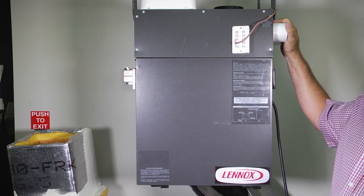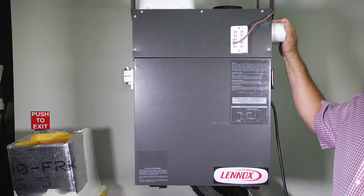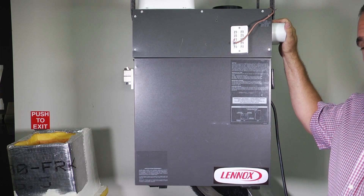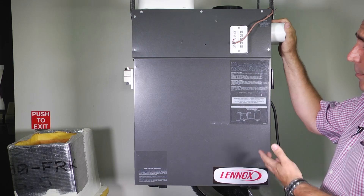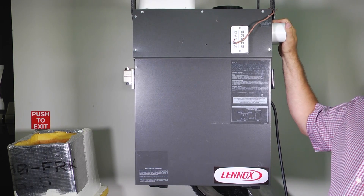What happens in a lot of our northern climates is in the wintertime we want to keep the house warm, so we shut up all our windows and doors. Part of the issue when we shut up all our windows and doors for six months out of the year — I'm from Canada, we get ice and snow a good four or five months out of the year — is we need to exchange air. When we don't exchange air, we have issues like black mold showing up and all sorts of other things. So we want to make sure we get those air changes built into the house.